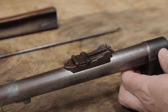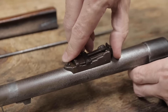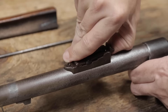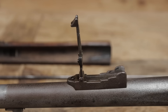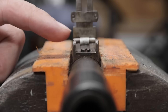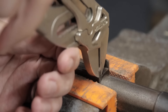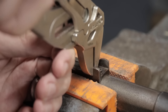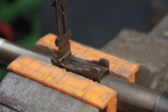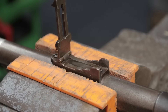The rear sight does have an issue that needs to be addressed. These ears were squeezed inwards, making it hard to flip up the sight ladder. Also the ladder itself is bent — it should be straight. I'll move the action to the vise to fix these issues, starting with the sight base. It looks like the ear on the left is bent inwards and needs to be pushed out; the right one is perfectly vertical. Before resorting to a punch, I'll give these plier wrenches a shot — and that did the trick. It's always best to try methods that you have better control over first.